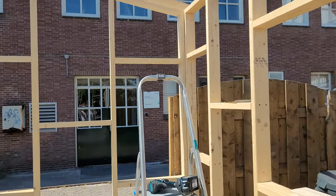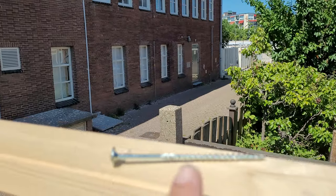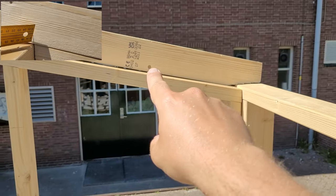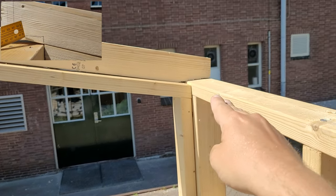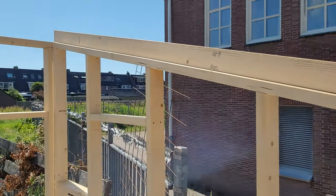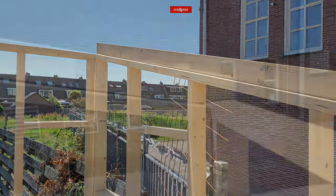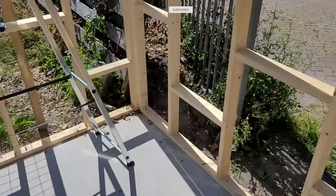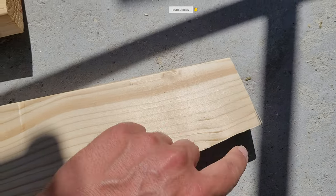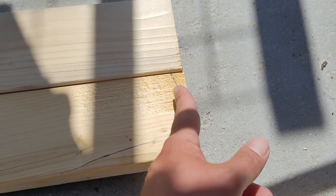One detail I was noting in time: when I went to the other side, I just removed the beam that was made to fit in these beams, but the first beam cannot lie flat because it's not at the same angle over here. This is straight, so I have cut out an angle over there. So all we'll do is make them all exactly like this one, with these corners cut out. Got one, this is the old beam I just removed, has exactly the same end here, so I'm drawing that on the new beams, so it will lay flush and have a flush side with the outer wall.